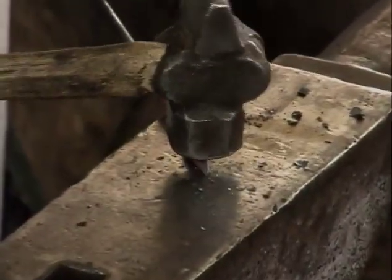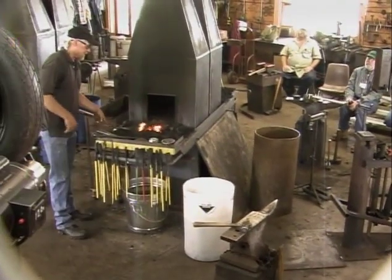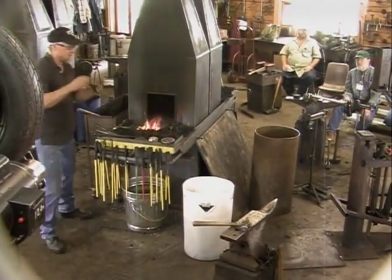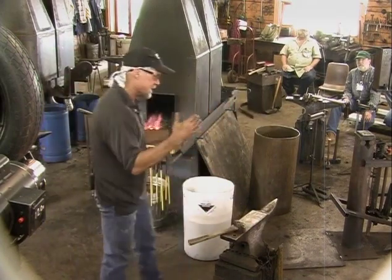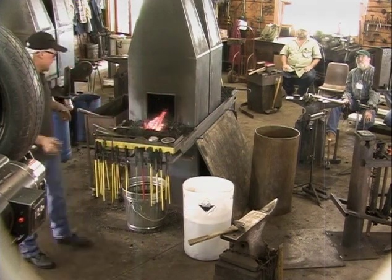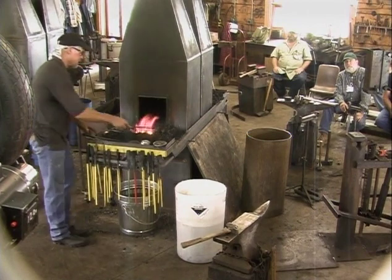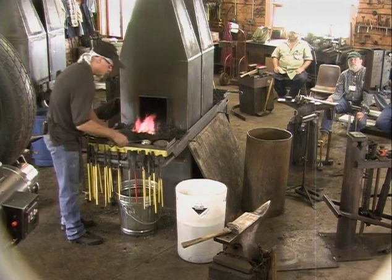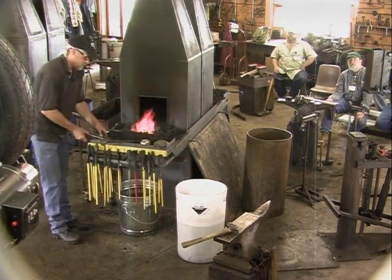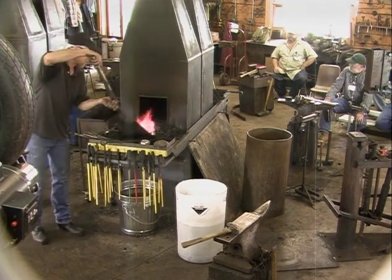What I'm going to do is flatten that down, and then I'll turn my hammer over, and usually you have enough heat to spread out one side. You start in the middle, of course. And you can make that middle as thin as you want. What you try to avoid is making the edge super thin, because then it's too foily. And then later when you're trying to cut serrations in it, it'll buckle or fold instead of letting you cut into it. So whenever you spread things, I'm sure there's exceptions, but nearly everything I do, you start in the center and then work it from there out.